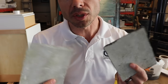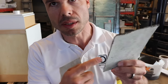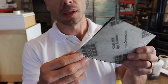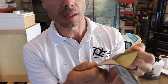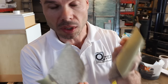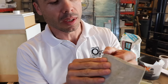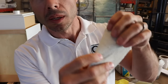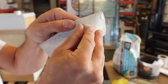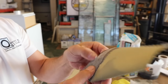I get asked why I don't use RedGuard or HydroBand to do the seams. Here's why: I have two sheets of KERDI membrane adhered together with 8 Plus 9, and after a 16-hour cure, when I peel them apart it's actually ripping the membrane — the 8 Plus 9 has cured fully without air, between two sheets of waterproof membrane. I did the same thing with the Hydro Band Cementitious — it just comes right apart, still wet, still crumbly, hasn't cured at all.